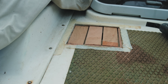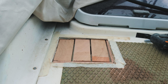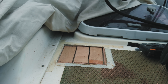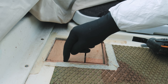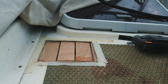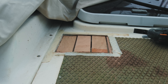The plan is to keep a slight gap between each section. We've got plenty of epoxy and we're going to mix it with silica, which is like a structural thixotropic dust. We'll have plenty of that in all the holes, put the ply in, make sure it's between everything, smooth off the surface and let it cure. The next stage will then be to taper our laminate into the core we've added, ready to put new laminate in.